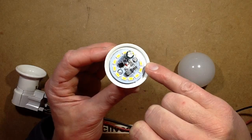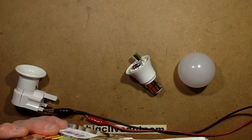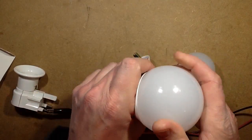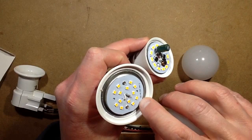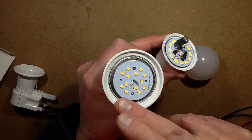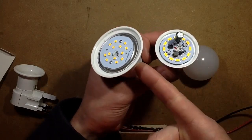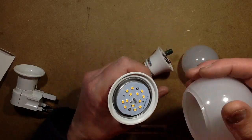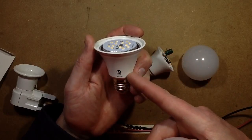This construction is very similar to some lamps I got from Banggood recently. This one is the Didylar, a mains voltage version. As you can see, the construction is relatively similar inside — the same metal cup arrangement and a plate across the top with the LEDs screwed in. This one's notable because its power factor was very good at over 0.9, which means it definitely has a switching regulator inside. It's 12 watts and quite a nice lamp. I'll take it apart in a different video.